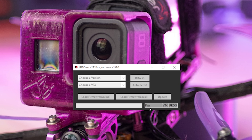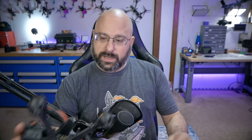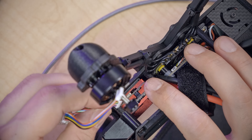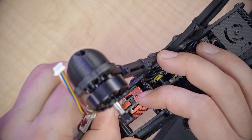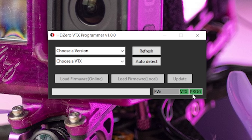The first thing you're going to see is down here in the lower right, these status indicators are grayed out. So the first thing you'll see when you plug in the programmer is that PROG should turn green. And then when we connect it to the video transmitter, we should see VTX turn green. We are going to have to go through this annoying business with the teeny tiny connector — there's no way around it, but we can just be super careful. At least without a giant set of goggles hanging off the thing, it's going to be easier to get it lined up, get it the right way up, and get it plugged in. And you can see right here: VTX is green, PROG is green — that's what we want to see.